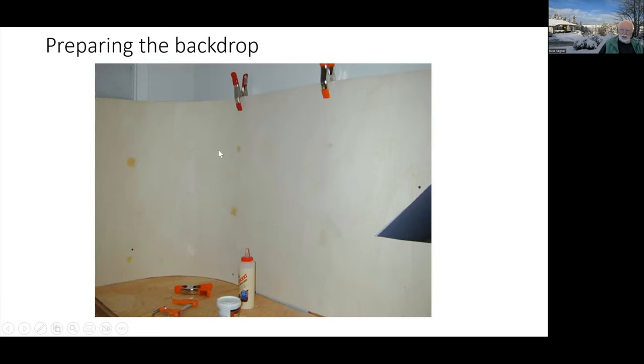And the nice thing about it is you anchor it with either glue or, in this case, sheetrock screws onto some boards behind here that are tied to the bench work. And then you back the screw out, and you fill the hole with wood putty, sand it down, prime it and paint it, and it ends up just dead smooth. And it's very, very stable.